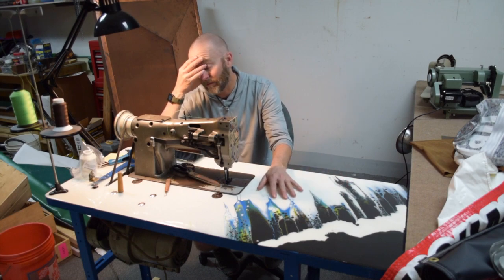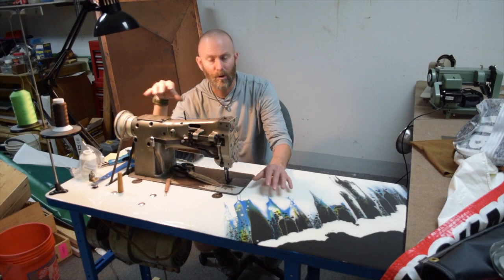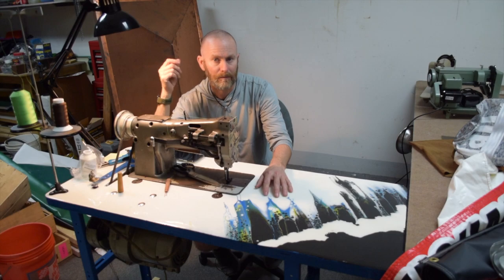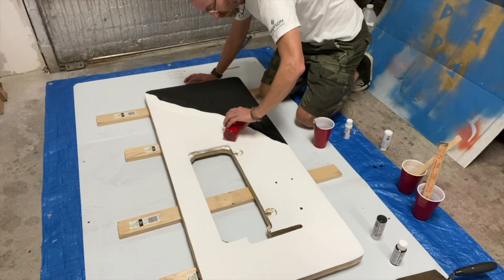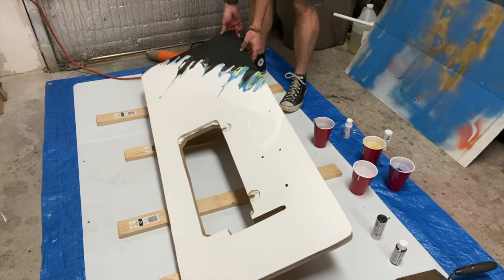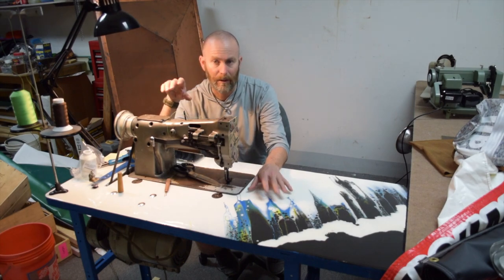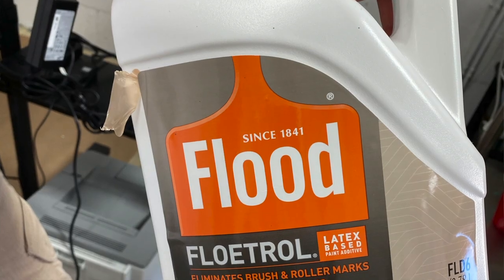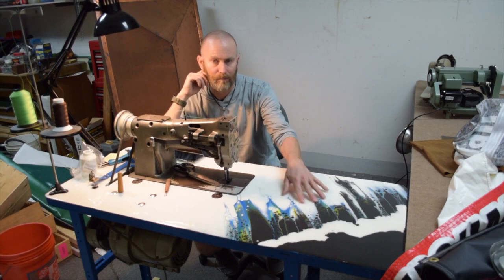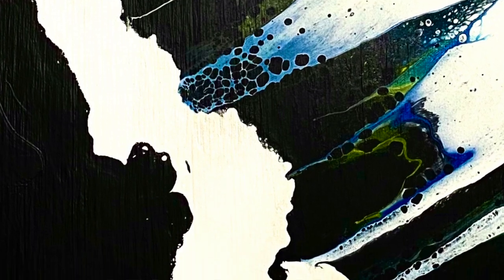For the top, I went back and forth on a couple of different options, as far as whether to finish it somehow and leave the wood finish. I work in a community of artists — I'm surrounded by painters where I work, and one of them exposed me to the Dutch pour method that I had not heard of before. I did a little bit of YouTubing and it looks pretty simple, so I thought that'd be kind of fun to try. I bought the cheapest acrylic paint I could buy and followed a recipe for thinning the paint to make it pourable — it's like one part paint to one part of a substance called Floetrol. I just eyeballed the measurements, used a heat gun instead of a hair dryer to blow it around, basically just winged it, and this was the end result. It looks fantastic to me. I really like how it turned out.